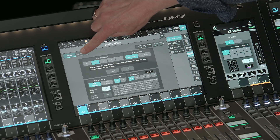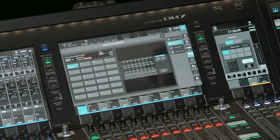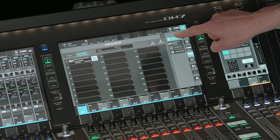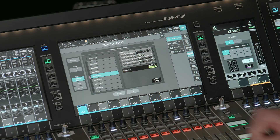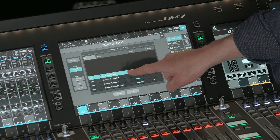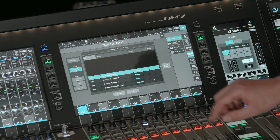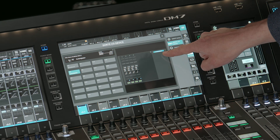Next, let's get control of the devices. We move over to device mount, where we can control up to 24 devices. Touching any of the blank spaces, we see a list of all the devices we could control. Switching to online devices, we can now see all connected devices. At the top: Y001 Shure SLXD. Let's press device identify to flash the front panel. Touching OK to connect — we can see it's connected, it's synchronizing, and it's going to become controllable.